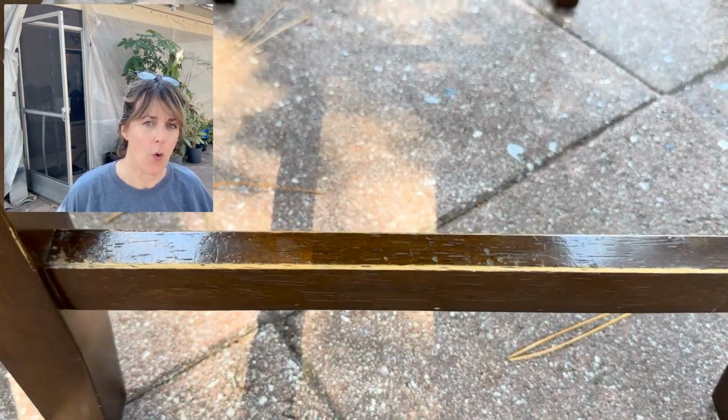Before talking final results, I do have to say that this wasn't exactly the nicest test I could give these products. It wasn't that they weren't fair, I mean, three chairs, similar woods, similar damage, but these chairs are poplar wood. They were really big in the 80s and 90s, and poplar is still used to this day. It is notorious for being very hard to stain. It takes stain very unevenly, and it's a rough piece to work with. So my results with these were probably going to be the same if you're working with something similar, but I can't say for certain for anything else that has a poly top.